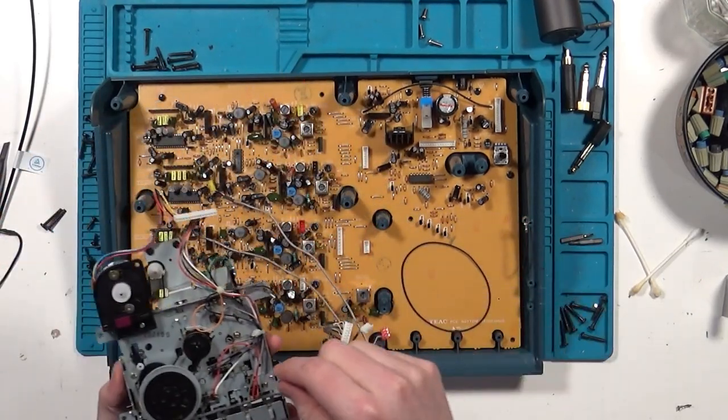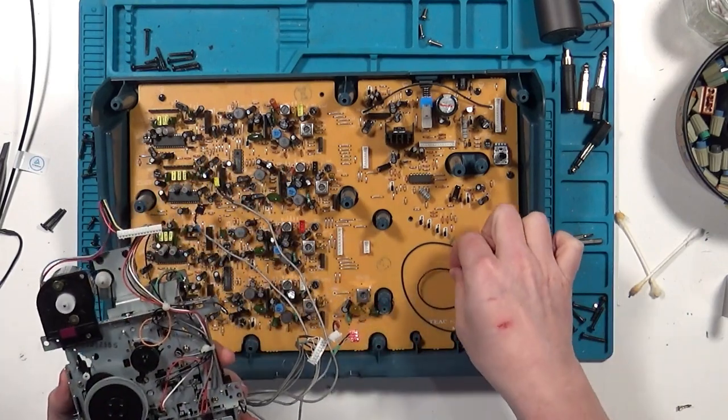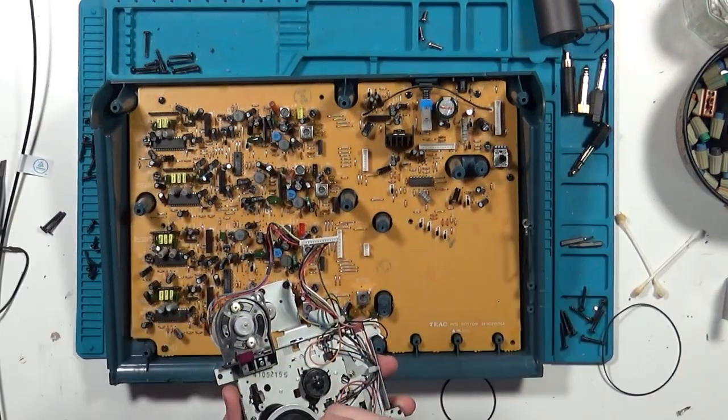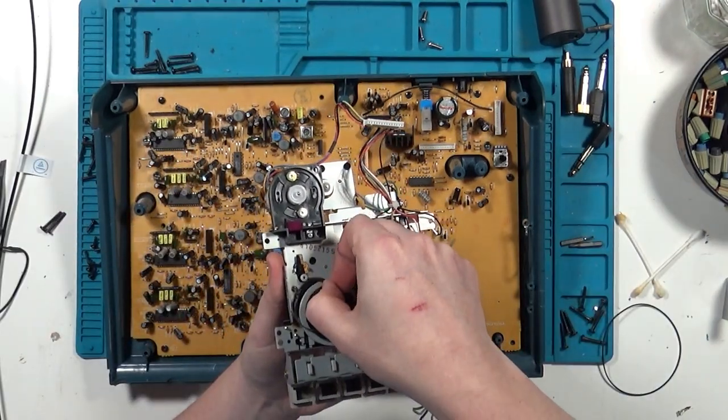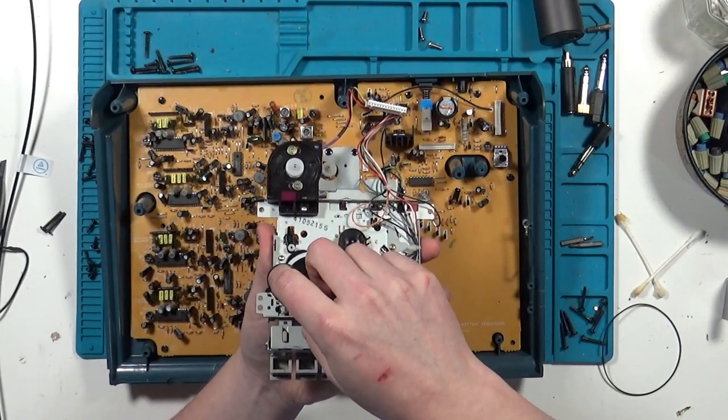You can see that the 3 belts aren't in terrible shape, but when laid out, they should go back to being totally round. The 2 main drive belts are slightly out of round and have some lumpy bits to them, so they definitely need to be changed. The counter belt is quite out of round and stretched, but that's common on the 414 series.